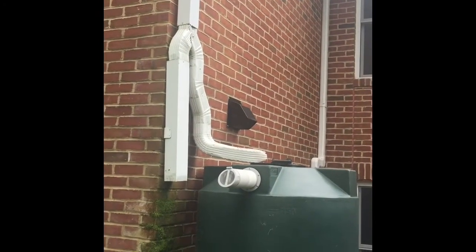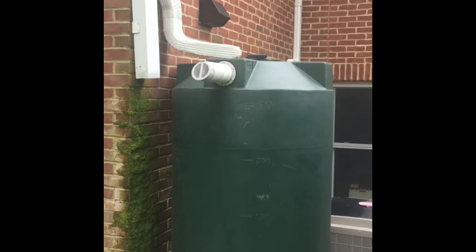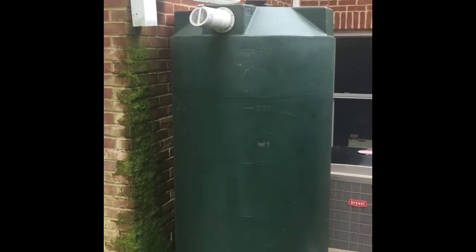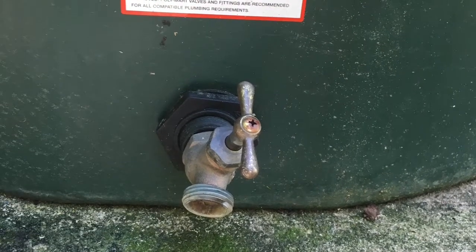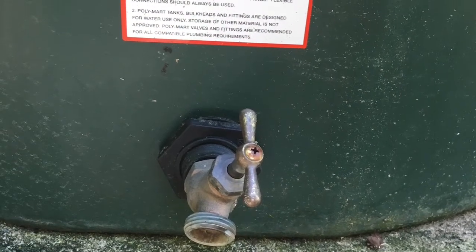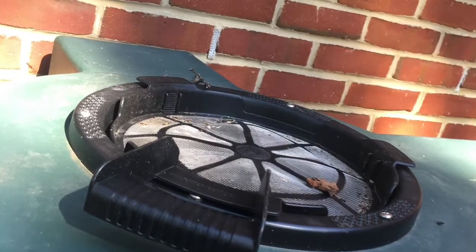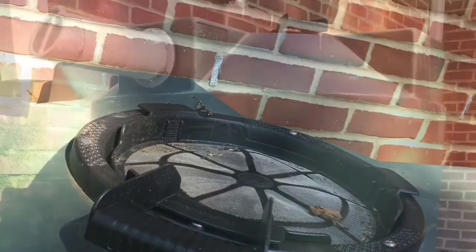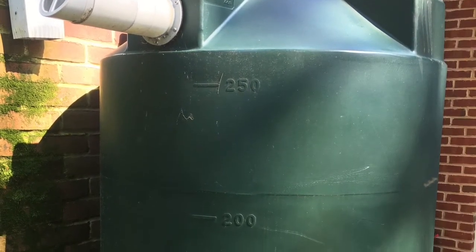Cisterns, such as this, are much larger than rain barrels and can collect water from several downspouts from one roof. They have capacities ranging from 100 to several thousand gallons. Both systems have spigots at the bottom that can connect to garden hoses for easy access. Designs also include a screen or closed top to keep out debris and mosquitoes, and overflow ports that allow excess water to drain when the system is full.